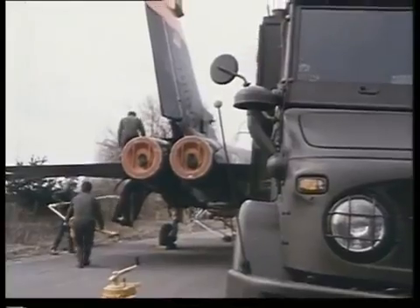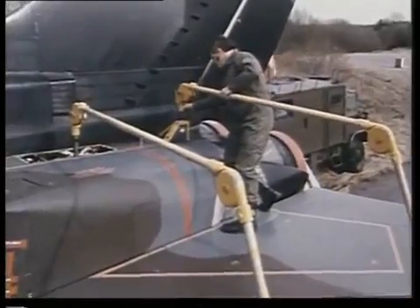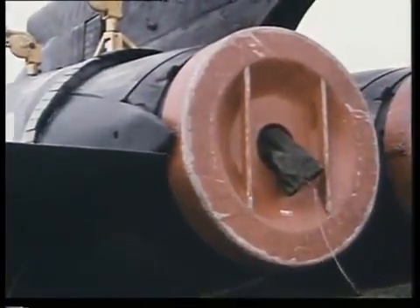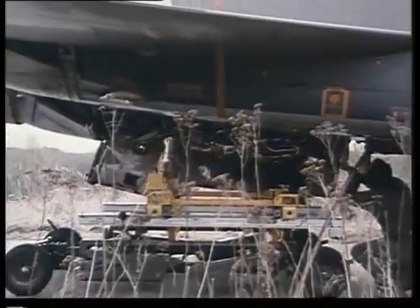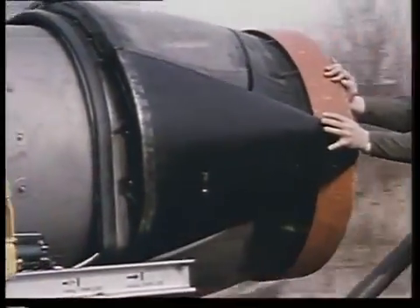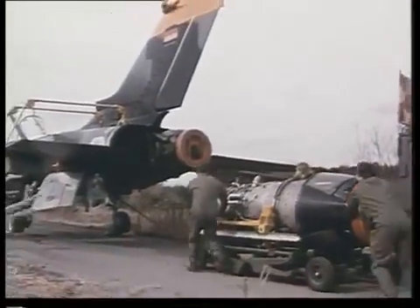To change a Tornado's engine, the lower fairing shell of the engine compartment is opened. After undoing the quick-release connections to the fuselage, the RB199 is lowered by mini-hoists onto a dolly. Even under field conditions, the whole procedure only takes a few minutes. The engine weighs only 2,000 pounds — less than half as much as that of an F-111. The old engine is wheeled away, its replacement brought up, hoisted into place, and connected up in a similarly short space of time.